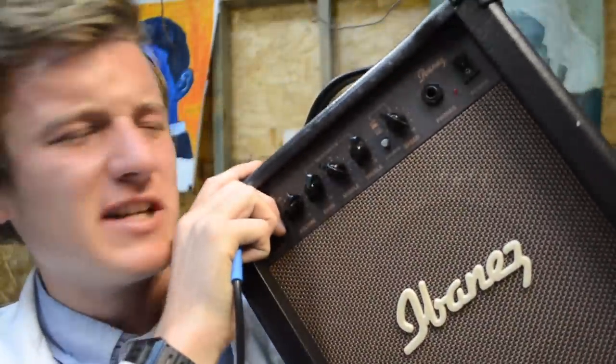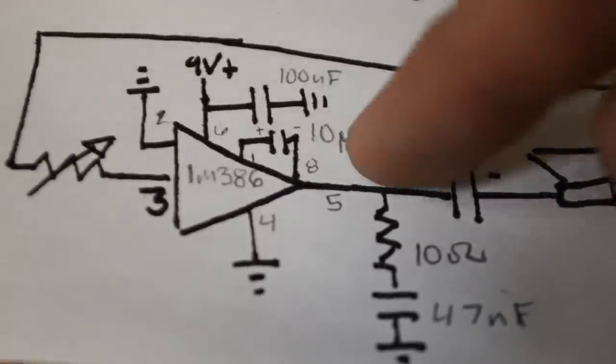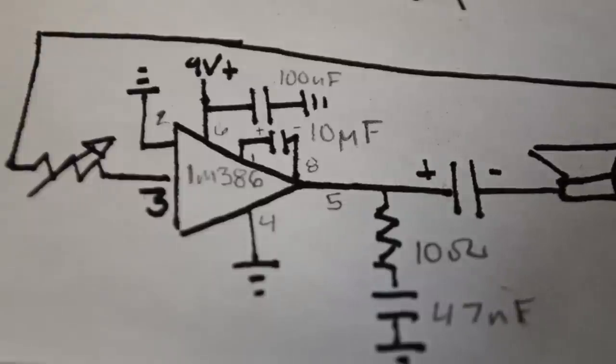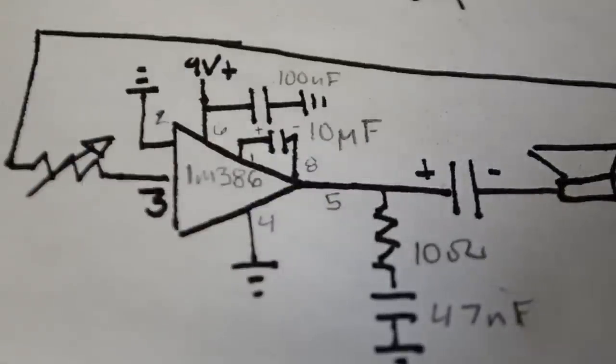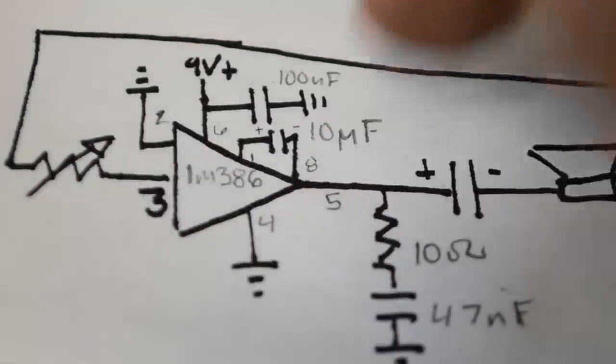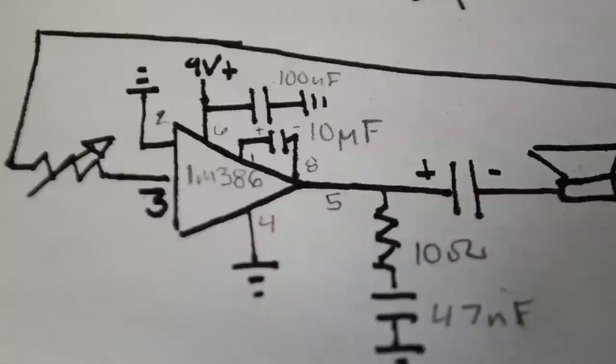Now the very last thing we need to do is connect that audio output to an amplifier. Guitar amps work really great for this because they have a high amplification value, but most people probably don't have one, so let me show you how to make a quick external amplifier. Our amplification circuit is centered around the LM386 chip — it's a pretty common and cheap chip. The audio input goes in through pin 3, and a potentiometer adjusts the volume. Pins are connected as follows: 2, 6, 1, 8, 5, and 4.